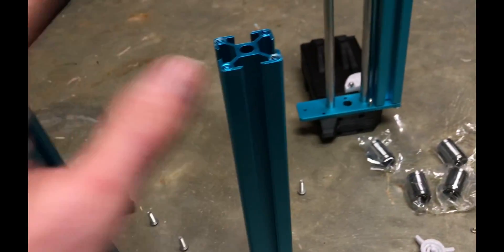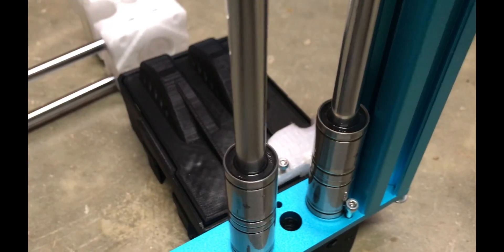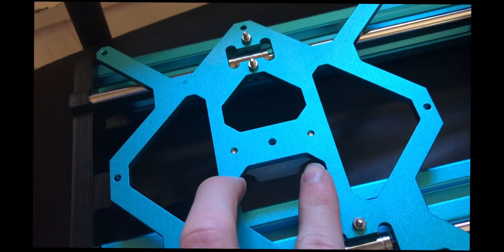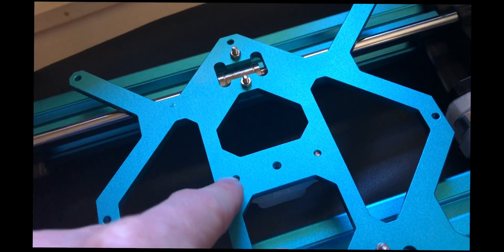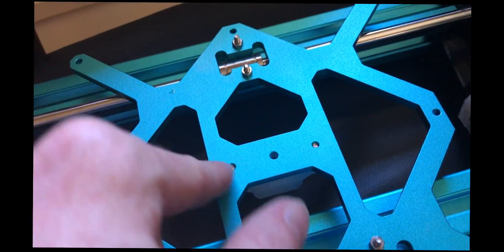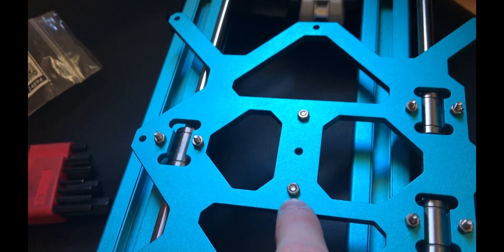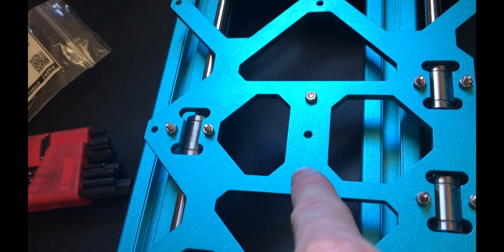So what I want to do assembling the Y-axis is attach the U-bolts and bearings on the white carriage plate, then slip it over the rods while disassembled, and then screw it all back into place. Okay, so all the bearings are on. I've got the Y-axis, X-axis, and Z-axis. On the Y-axis I'm going to replace these two screws with something a little bit longer because I don't like the way they fit. I'm going to replace the M3x10 screws with an M3x20 or M3x18, just so I can get a hex nut over it. I got the M3x10 screw replaced with an M3x14, which gave me enough room to put a hex nut on it so the screw won't fall out as the bed moves and vibrates.